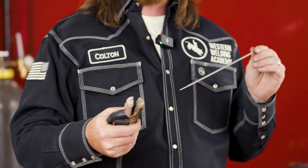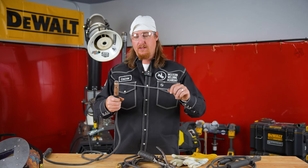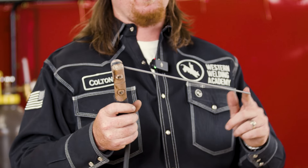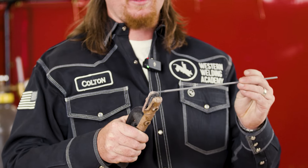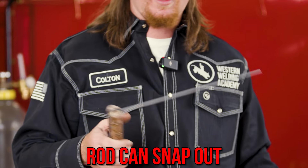These have teeth in them with nice little grooves that hold your welding rod in there — they do a pretty good job. A lot of guys like to bend their rods, especially if they're welding overhead. But if you start putting a lot of pressure on them, they'll start to move. Or if you don't quite have it clicked in all the way, you'll start welding and then that rod will snap down on you — boom — and you've left an arc mark.